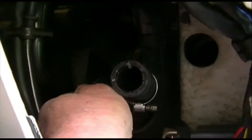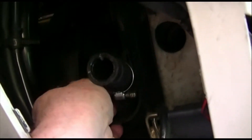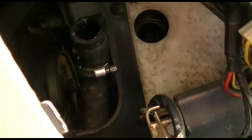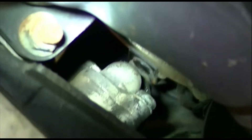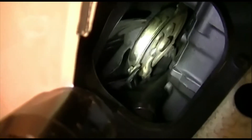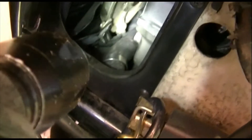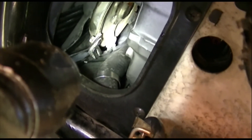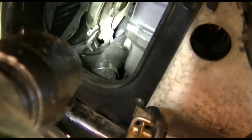We're going to leave this loose because we've got to twist and position this other tube and try to take as much stress off that fitting on the cylinder as we can so that it doesn't fail. Even though you can't reach your hand in from the right side, you can inspect it from the right side. If you're having trouble seeing how far the hose is pushed up on the fitting, you'll do it by feel but you can also get over on the right side and look at it. You're going to have to kink this hose and bend it in the middle to get it on that fitting, but if you use that lubricant on the inside of the hose and on the fitting, it will slide right on there.